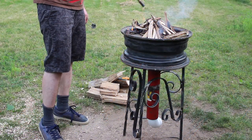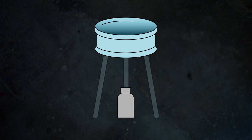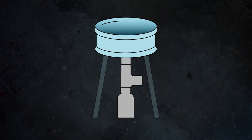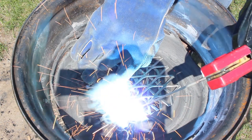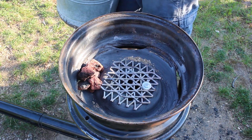The forge was just about ready to use — I only needed to get the blower hooked up. I first tested things out using a 90 degree elbow. Next, I decided to add an ash trap to prevent any bits of fallen ash from being kicked back out once the blower was turned on again. The trap was fabricated using a 16 ounce propane bottle and a two inch collar made from a cutoff piece of the blower pipe. It's connected to the forge using a PVC T connector. I know PVC isn't the best choice for this application, but so far I haven't run into any issues with it getting too hot. To prevent hot coals from falling down the pipe, I added a grate made from some scraps of expanded metal. To plug up the holes in the wheel, I spread some lava rocks on the inside of the wheel.